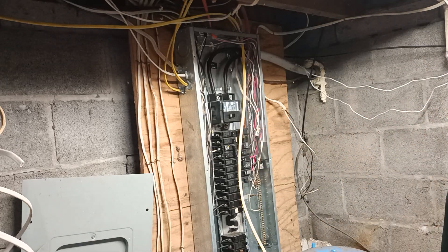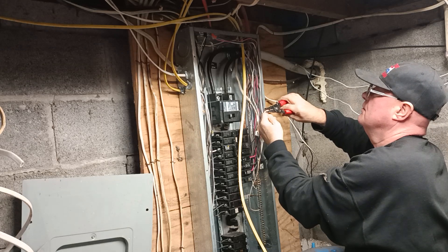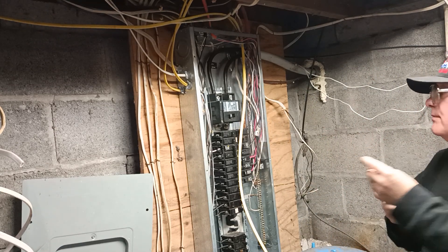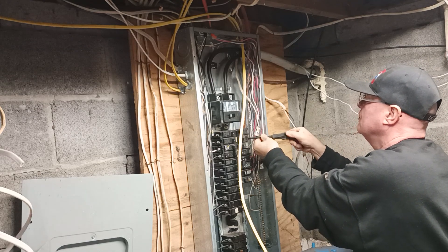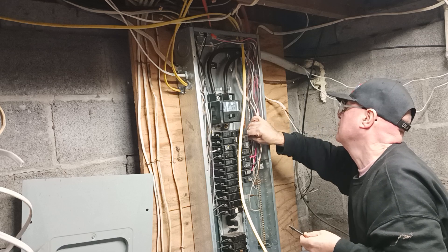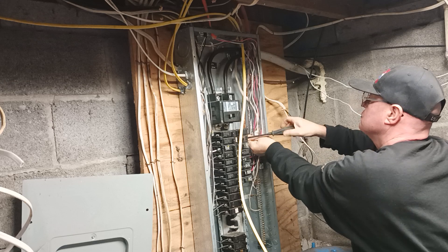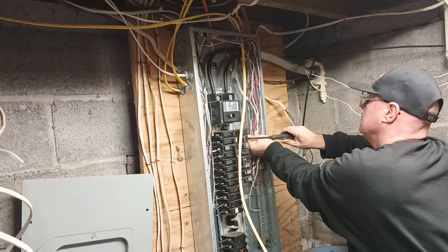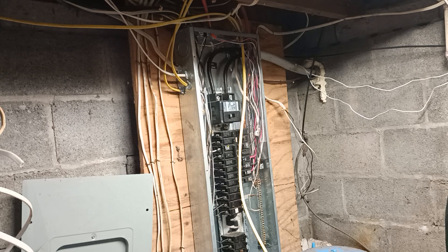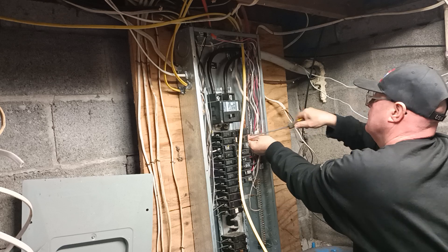Now it is, yes. We'll put the hole that matches the wire size we're using. We'll put our black wire under the 15-amp breaker. 14 is the minimum gauge wire for house wiring and you put it on a 15-amp breaker for a lighting circuit. You can put outlets on 14, but they prefer 12. And 12 is required in the kitchen. Campers use 14 for outlets, but they're really not going to work them that hard.